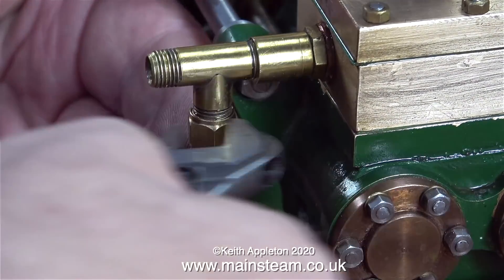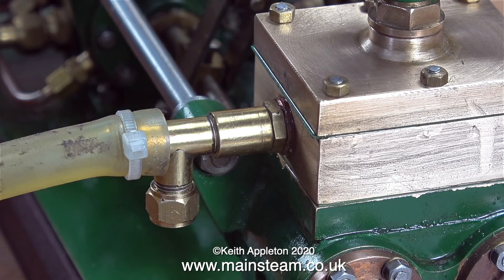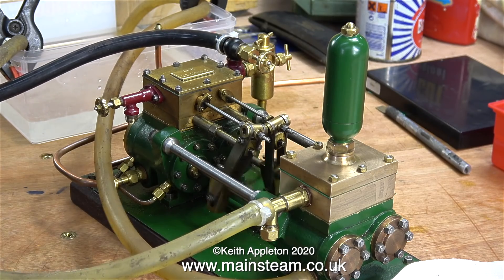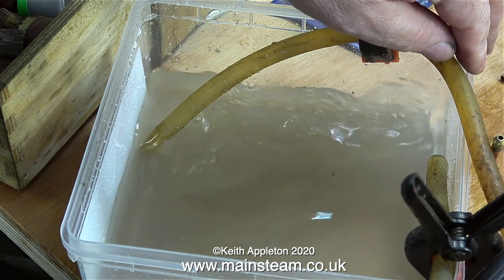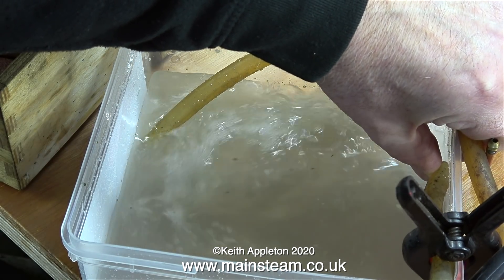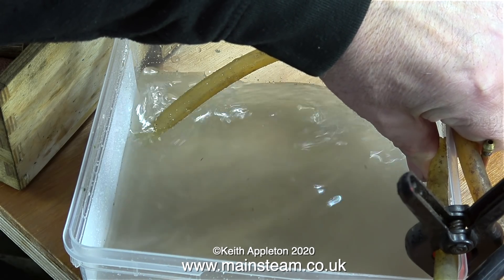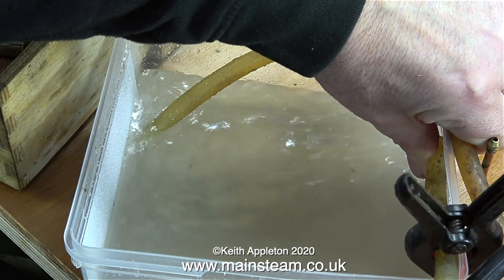Here's a good tip: I'm using a stainless steel ball and a union nut to block up one of the outlets from the T-piece. Now it's time to test the pump — with a piece of silicone rubber tubing attached to the output and the input, and connecting the compressed air line it immediately bursts into life. A good sign is it didn't need priming; the pump sucked the water into the tube and is now happily pumping it out of the other pipe. When I squeeze the other pipe to restrict the flow there's quite a lot of pressure there.